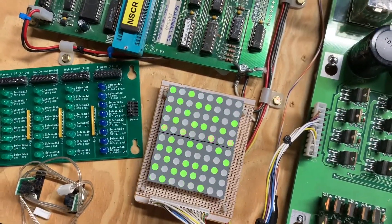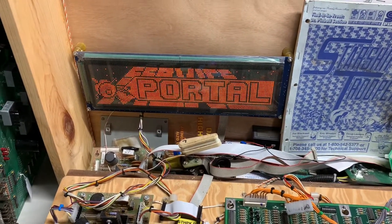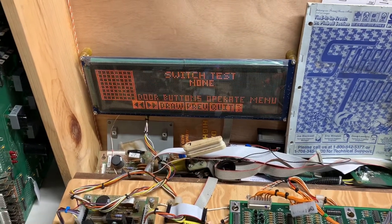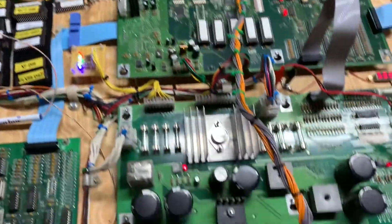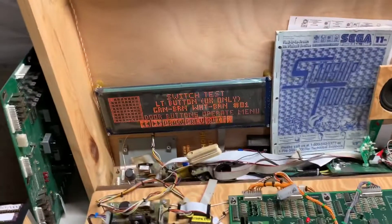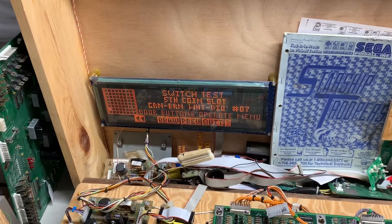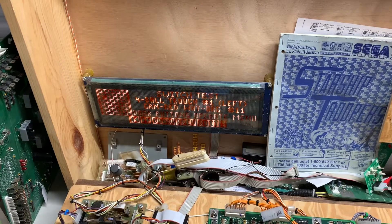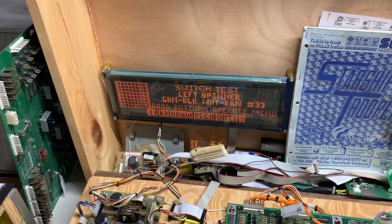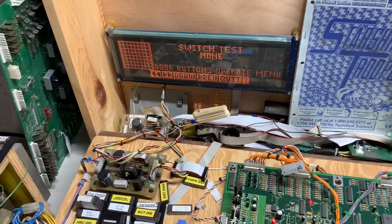The lamp matrix is doing what it does. Let's put it into test and attach switches first. I have my PennyTek tester. Switch 3 on White Star Games is never reported, so let me do another one in row 3. Here's row 1. Everything in the switch matrix is doing what it should.